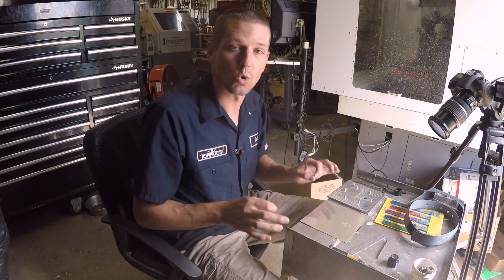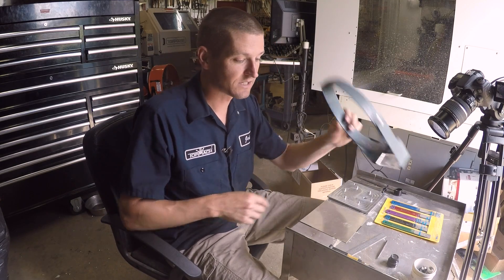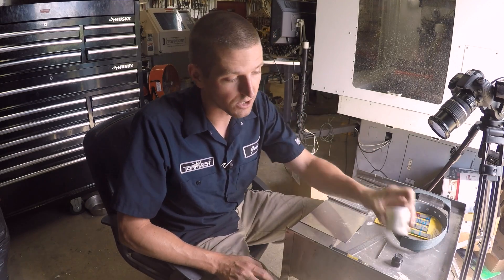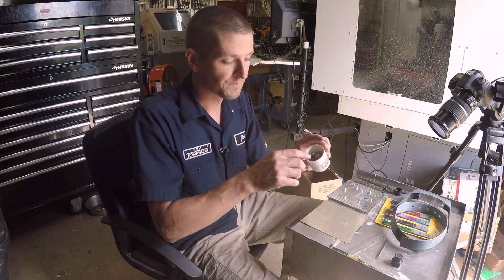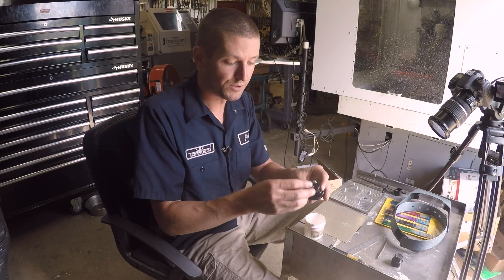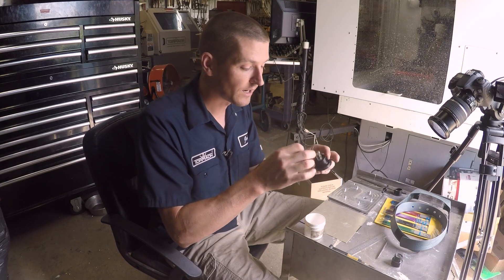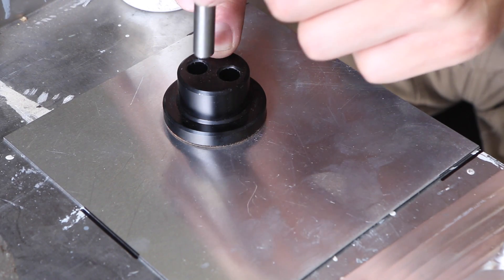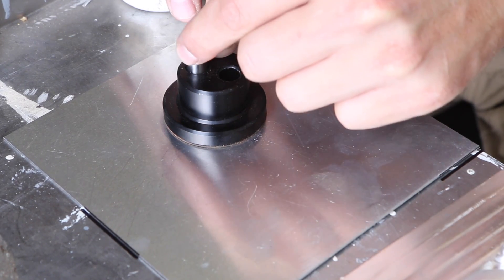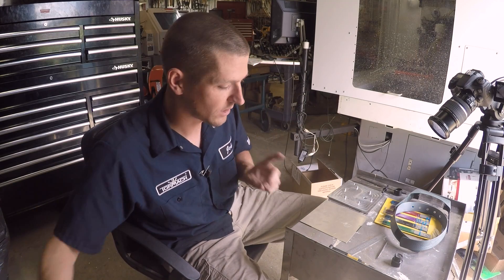You need some sort of magnification. Some guys have it built into their eyeglasses. Tom was recommending using these. I also have this little 10x loupe — it's like a few bucks. We also have, though we're not going to use it today, an optical center finder, which is phenomenal. You look through this piece, it has a reticle on it, you put it over your hole magnified, then swap it with the punch and punch it down — very easy to be accurate. But that's cheating for purposes of this video, so we won't use it.